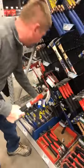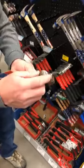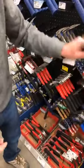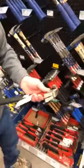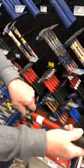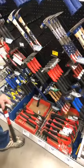This is a good hammer for household uses. It's got a nice, pretty good-sized head - the bigger the head, the easier it is to hit the nail. You've got to hit the nail on the head to get them driven. This has a good size, and it's pretty flat so you're not going to deflect off the nail. It's also got a good pull leverage here so you can get underneath the nail. The claw curves all the way back, which gives you good leverage to pull. That's why it's curved so much.